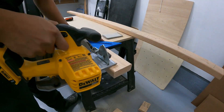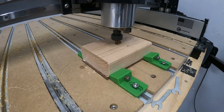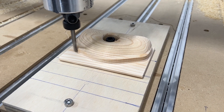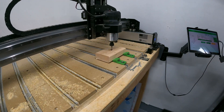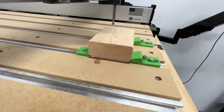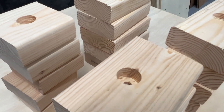With the panels done, it was time to move on to the holds. From the CAM models I knew all the different lengths I needed to cut, so I marked them out and cut them with a skill saw. Each hold was done in two operations: the first operation cut the anchor hole for the 3/8-16 bolt, and in the second operation I used that anchor hole to hold the blank while I machined the complete outside of the hold — solving the problem of needing 360-degree access all the way to the deck. The CNC router was set to 150 inches per minute at 23,000 RPM, with about a 50 to 75 thousandths radial depth of cut and an axial depth of cut of 375 thousandths (3/8 inch).